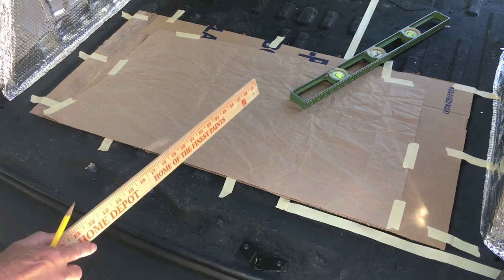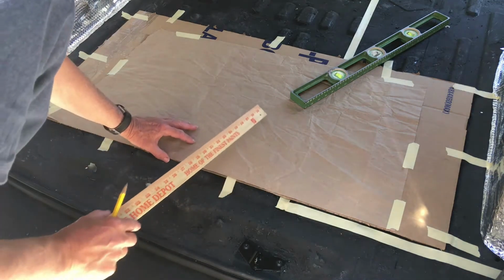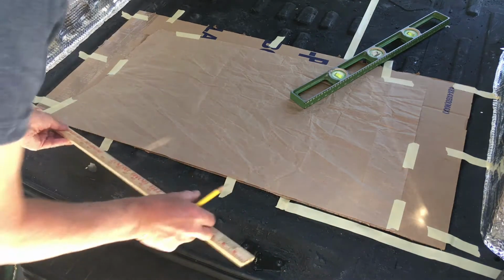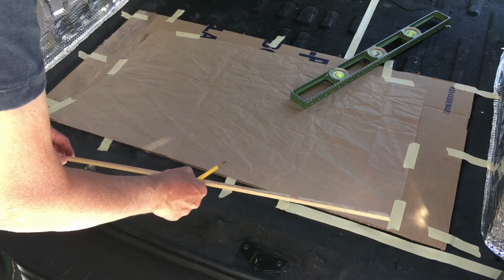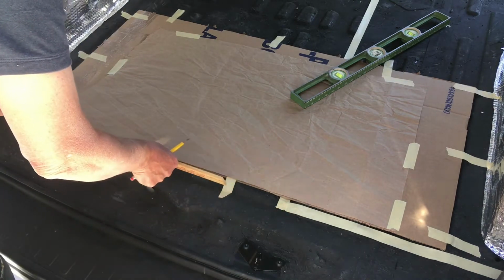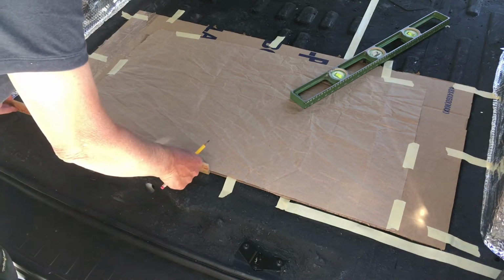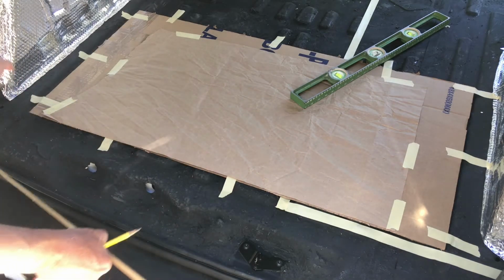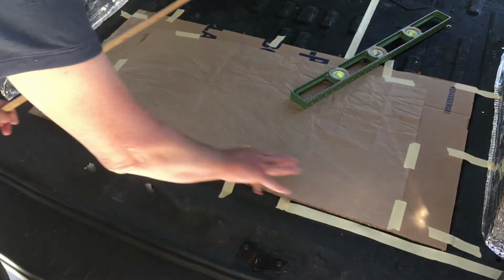The first thing to do is to make sure that your cardboard has a straight edge and that your paper also has a straight edge that you lay down on top of it. In this case, the straight edge for the paper in particular has to be located strategically so that you can reference some part of the van that you want to keep consistent. For example, I made the straight edge coincide with the point between the back of the left rear wheel well and the back of the right wheel well. So that creates a reference line.